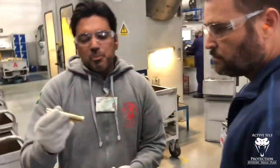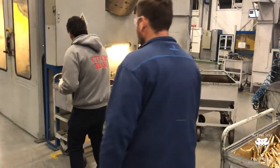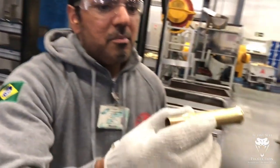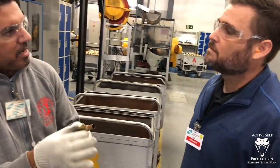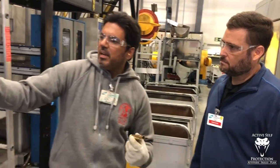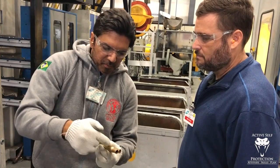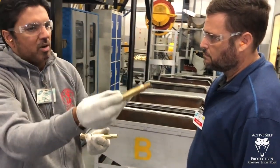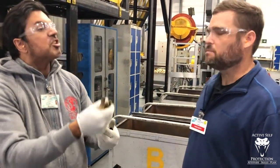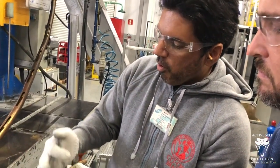This process requires washing prior to turning. This goes to washing. Why? Because after pressing, you have grease and oil here. Then you must wash prior to turning, because after here we have a very clean thing. Because if you have grease or oil on the surface, it's impossible to turn, and the surface will become dirty. That's why we wash before turning. And then we put it into grease, and we do grooving, and we put it to length.